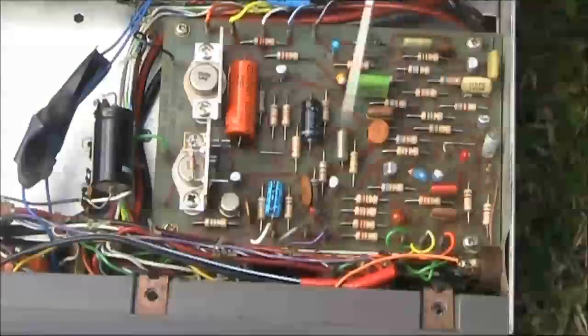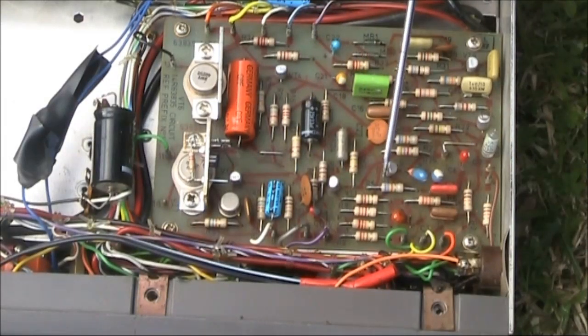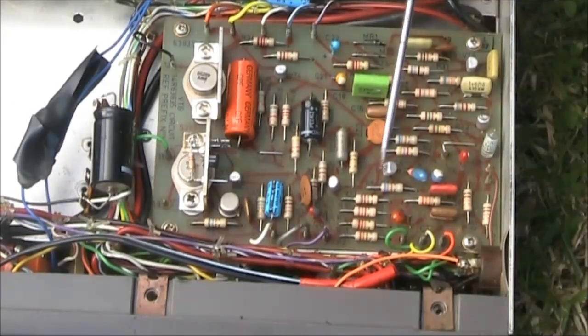This quite large board has got no RF inductors — audio type circuitry. You can see the transistors are getting bigger as you get towards the speaker, and this produces quite loud audio.